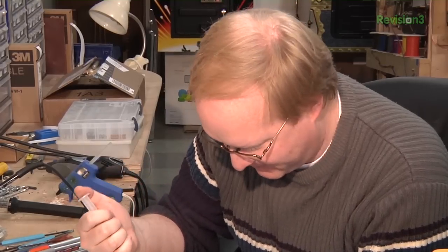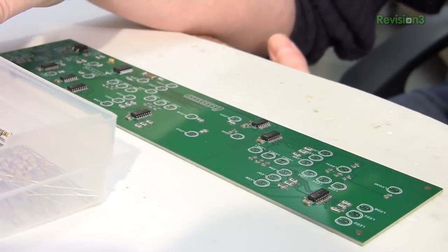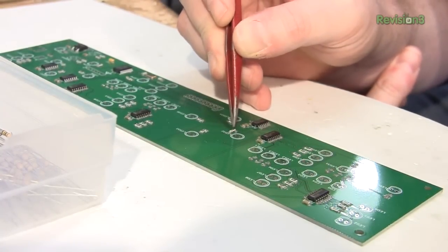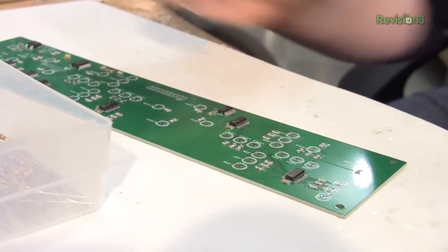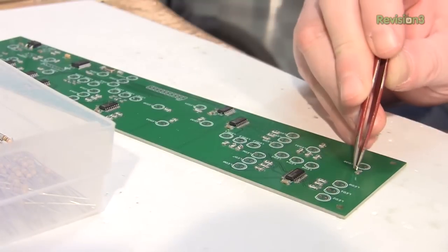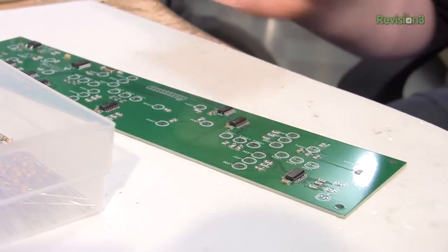You really have to push on the plunger to make the paste come out. Luckily, decades of video game playing have made my thumbs as strong as iron. With these surface mount resistors, there's something that can happen if you don't hit both sides of the paste with them properly — it can actually cause the part to flip up on end, stand up like a tombstone. And you're like, oh no, my solder job has died and now it has a tombstone.